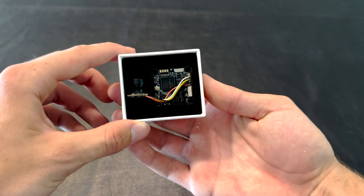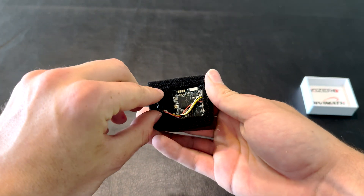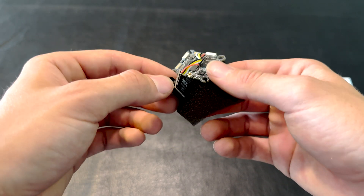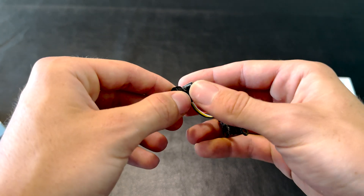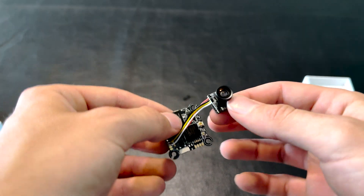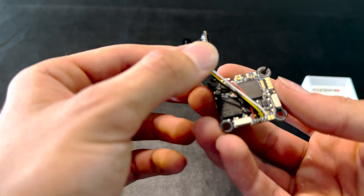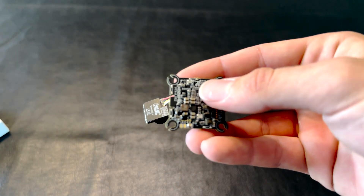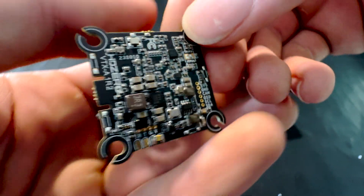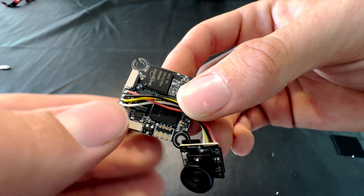The unit comes pre-soldered with the camera to the VTX. What's unique about this is it's a composite video system — normally HD0 is purely digital running at 720p or 540p on the 90Hz camera, but this one is actually an analog camera. That means you don't need to worry about a fragile MIPI cable. You might wonder what's the point of flying HD0 if it's analog, but what you get is a much higher quality video stream in general — it looks a lot better than normal analog. The back looks just like any other HD0 VTX except it's actually analog, which is pretty cool.